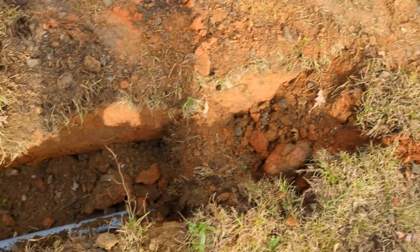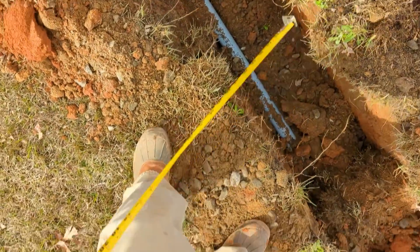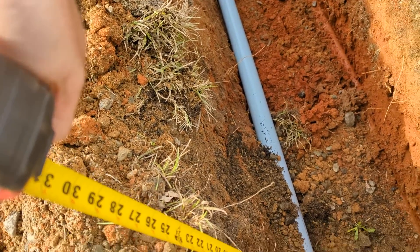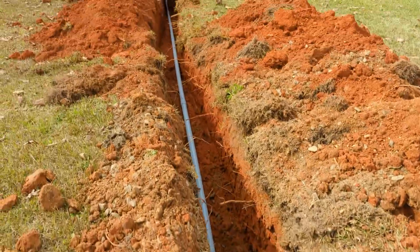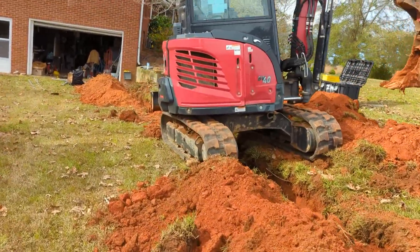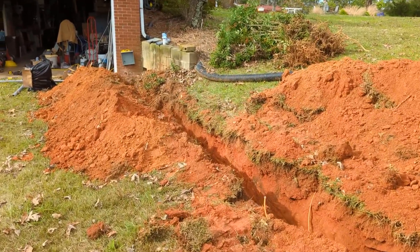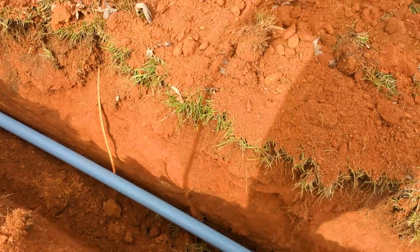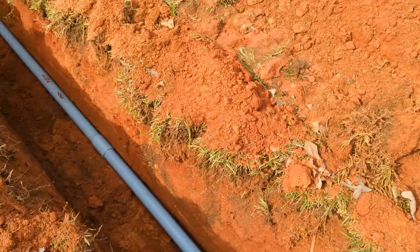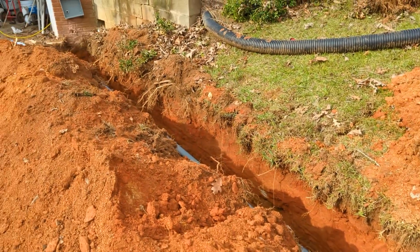Validating the trench depth here for inspection. We are 20 to 21 inches above the conduit, all the way — pretty much the same depth throughout. Minimum is 18 inches, so go ahead and backfill it — we are good. Checking one more spot: it's not quite sitting at the bottom, but I've got a good 20 inches there as well. Plenty deep, almost three feet there. That should be good enough for inspection.